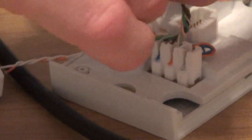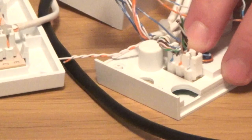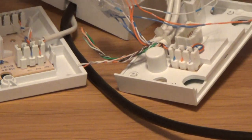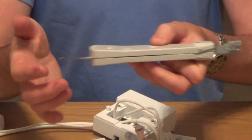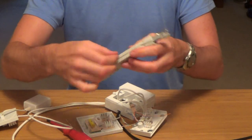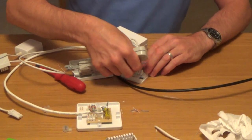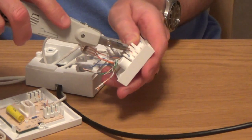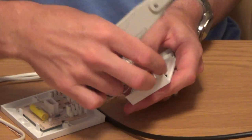Move the jelly crimps out of the way and connect these up like you would any normal wire — blue to terminal two. When using the crimping tool, don't leave the blade exposed because you can stab yourself. Always close both sides when working with it, and the cutting blade goes in this way so it cuts the excess wire. There you go — blue done into terminal two. Then orange to terminal three and white-blue to terminal five.